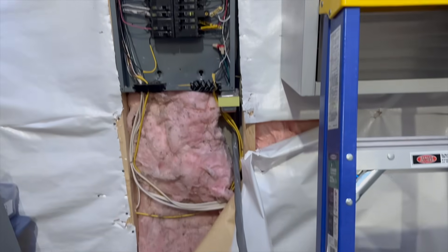We barely made any holes in the wall — just a couple to get the wire down for the charger, which will need to be patched up by a drywall guy. At the end of the project, we had an electrician friend, Noah, come in. He hooked it up professionally, made sure all of our work was to code — which thankfully it was. Noah also switched our main panel; we converted some breakers to tandem breakers to make space for the 100 amp breaker. The main panel was full, which is crazy because it's a new construction house.